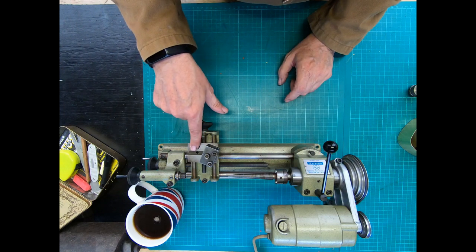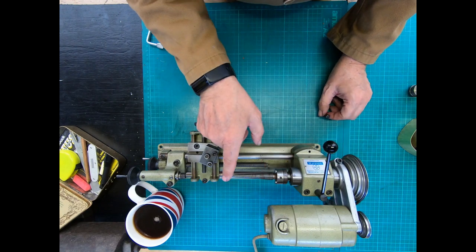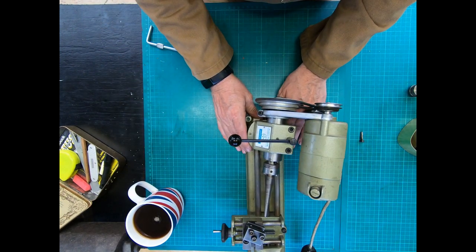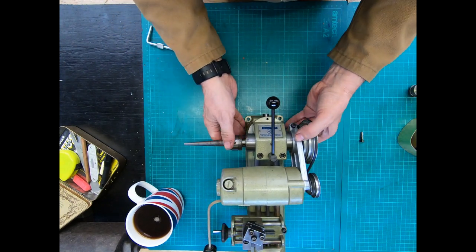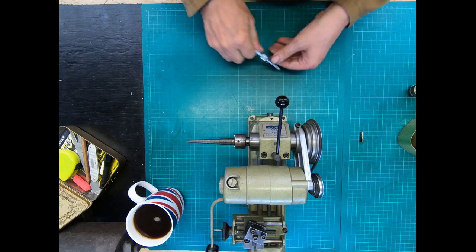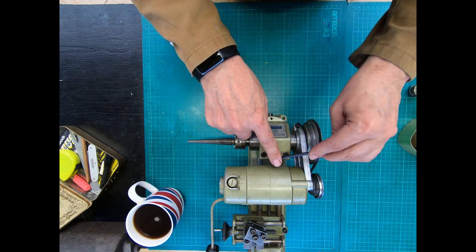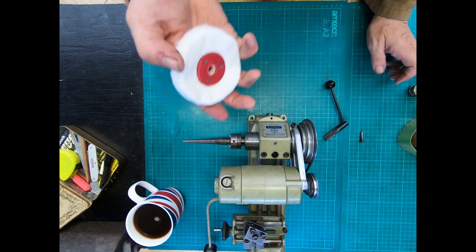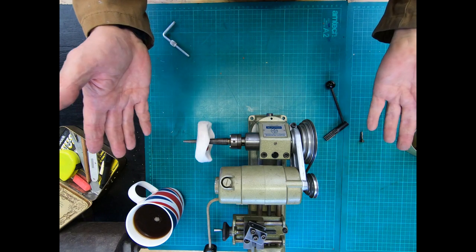What we do is something slightly different. We're going to configure the lathe to be in a different position. Wind the cross slide back towards the tailstock, take out the pin here which is your alignment pin for when you're turning in a straight or non-tapered fashion. There's a screw here which you undo to allow you to move the headstock. Turn it round, so now it's sitting on a different axis. Undo these two screws, push the furthest part away, do these two up again, and then you can add a buffing wheel to it.